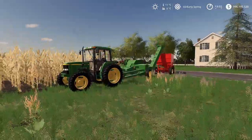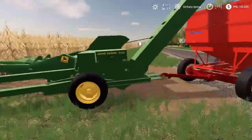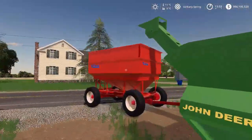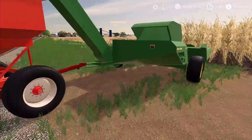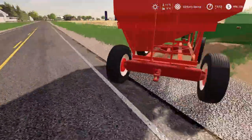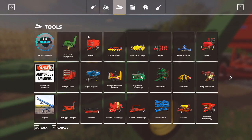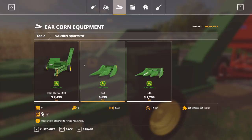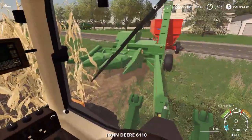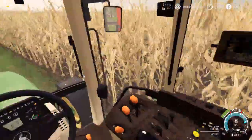Let's take a look at the John Deere 300 corn picker. It's a pull-type corn picker and the last corn picker John Deere ever offered. A corn picker only harvests ears of corn — it pulls the ear right off the plant and puts them in the bin. From there you take it to your corn crib and dry it, then you can grind it up or shell it and sell it. The 300 is also available with a two-row header — the 244 header. It only takes 75 horsepower to run it. Very basic operation, same idea as a pull-type forage harvester. As you can see the ears are just dropping into the wagon.